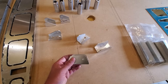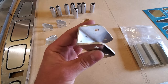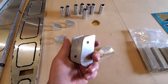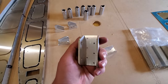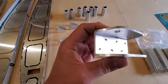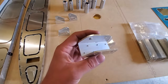Go ahead and fabricate these if you want. If you ever have to replace an angle or a piece of rectangular tube, you should probably contact us first. The inventory list tells you this is 6061 rectangular tube and gives you the dimensions, but if you ever buy materials on your own, make sure you're not buying something with a sharp radius or a sharp corner. You can see these have a radius inside and out on the extrusion — if you go with something that has a sharp edge, it will crack eventually. It's just a matter of time.